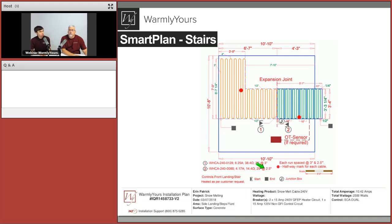We don't want to make that U-turn on the cable any tighter than that. The cable may just be damaged and it's just not going to bend the way you need to have it positioned in this plant. So yeah, 2.5 inch would be that minimum spacing you want to go with.